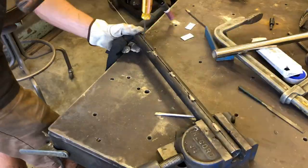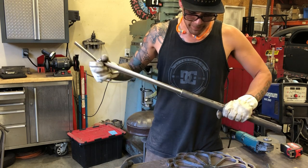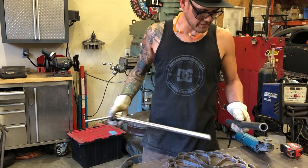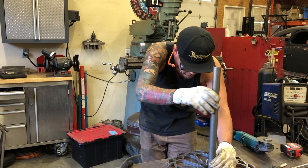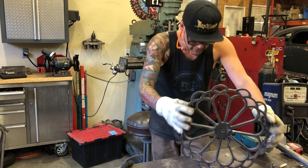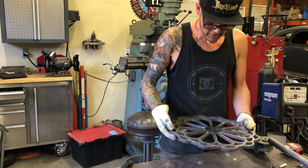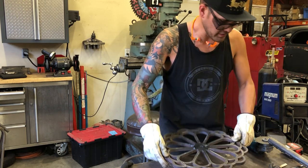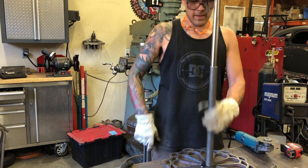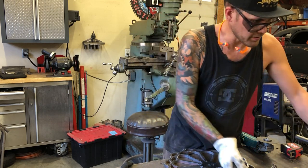All right, operation split and fit, success. We've got ample clearance to slide up and down, in and out, adjust for height. I think we're solved. So next up, I'm gonna clean this tube up a little bit, square it up on our base here. This is a base I cut out of half inch mild steel plate on the CNC. It was a design that Rustie, the tattoo artist this is for, sent me. She said she liked this design, so there it is. I'm just gonna weld this directly onto there. We still gotta make our little adjuster here and our top piece for the armrest, but just about got her beat.